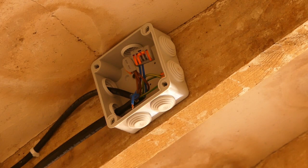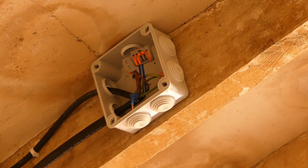I've got my lives from my main feed in and the lives that go to the switch in, and the two neutrals from the main feed in, with two spare ones there that are going to run back from the lights. The blue that's sticking down is going to be the live feed from the switch, so I'll put a three-way connector on that. One will go onto that and then the other two will be one for each light. The neutrals will come back into the two spare ones and the bigger connector. The three earths are just joined together — there's no earths on the actual lights themselves, just a positive and a negative.